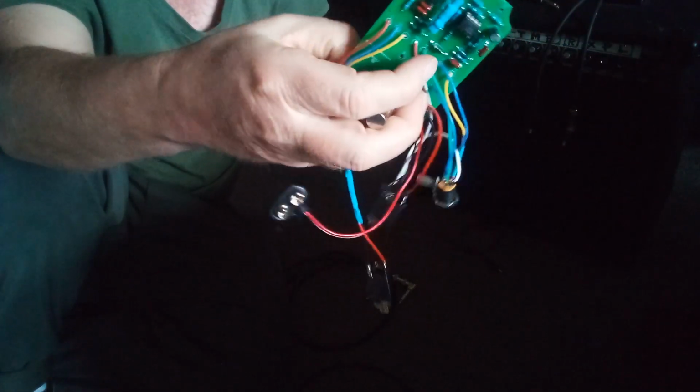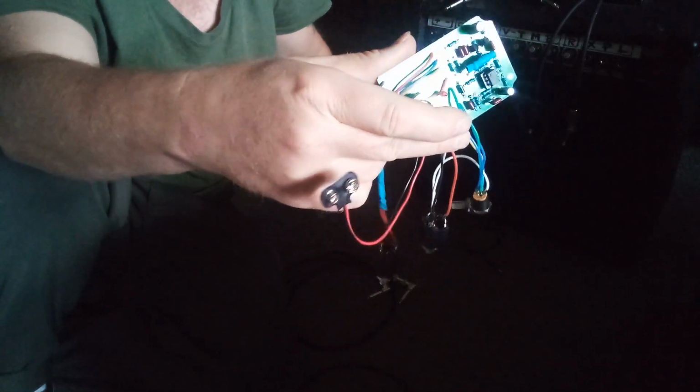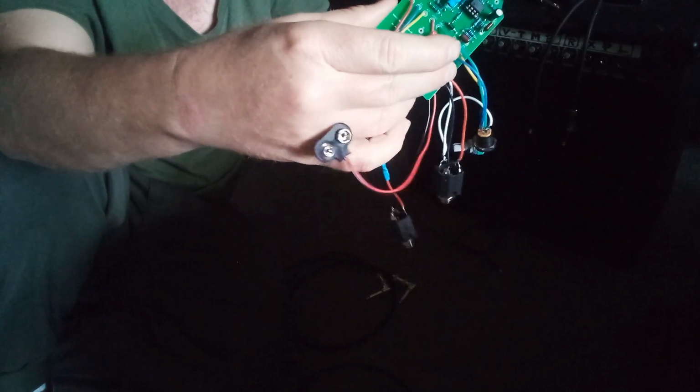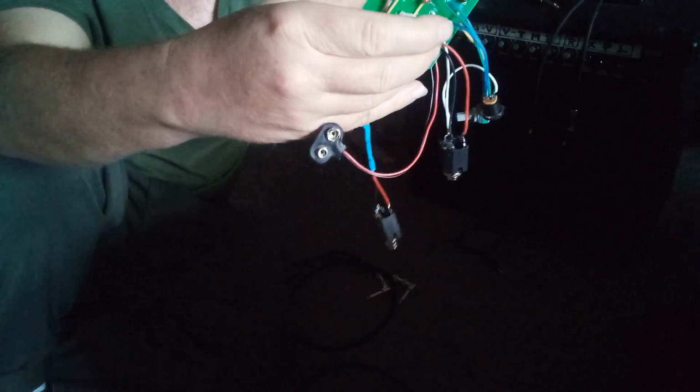But yeah, this compressor is very interactive if you've caught that, if you paid attention. When you turn the volume down, it becomes way more crushier. Yeah, that's notable. When you turn the volume up, it's a little more clear. So that's cool because you don't need the extra knob, because turning down unity gain is the extra knob if you're willing to forego that you might have to adjust the volume on your amp or your guitar a little bit, which could take out some highs, but that circuit sounds nice and bright. So there you go. Lantone compressor.